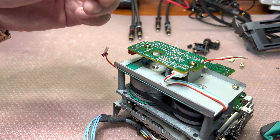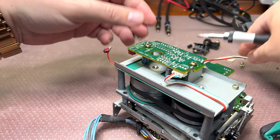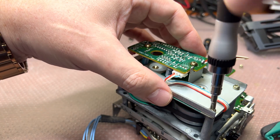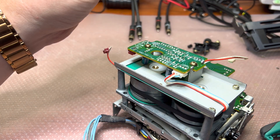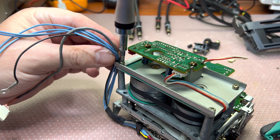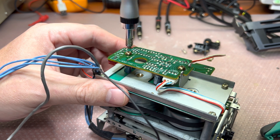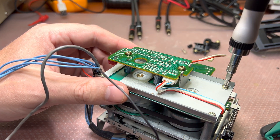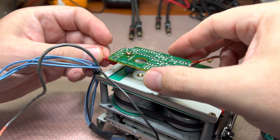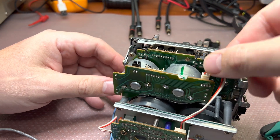Installing the screws. I'm not tightening them fully because there's no eccentric position, so we need to install all screws before tightening them up. The last one will hold the wires — don't tighten this one too tight, because I've made a couple of decks where this screw was over-tightened and it would not hold any longer. Just good enough. Now installing the connectors back, here and here.